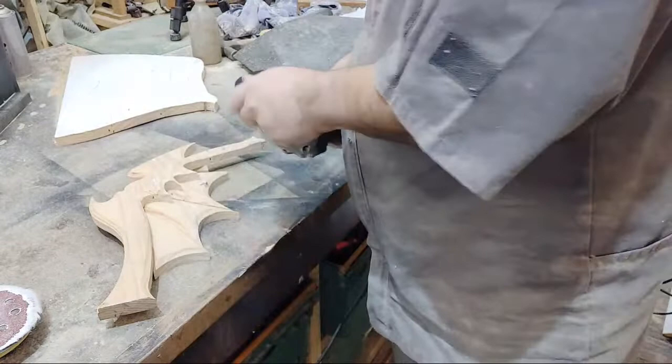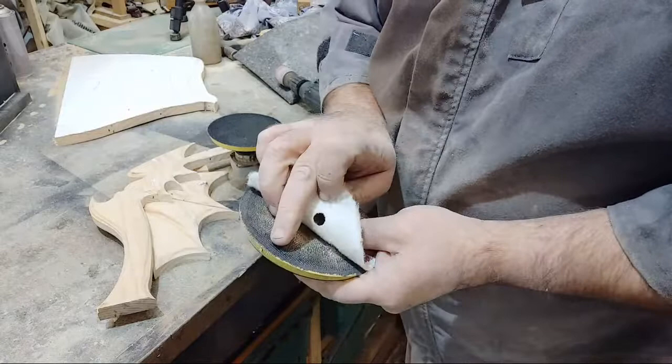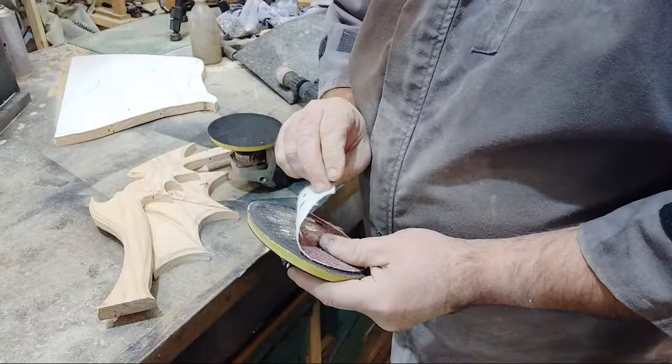The reason why you've got to do it is when you get a disc like this, and your backing pad, or any sanding disc, has become worn on the edges like that, it's not holding down, that's why it does this. Part of the reason anyway. They'll do that eventually, but this is a fairly new pad, it's fairly sharp, so it's kind of ruined the pad. You can see the state of that backing pad has had it. So that's a chugger.